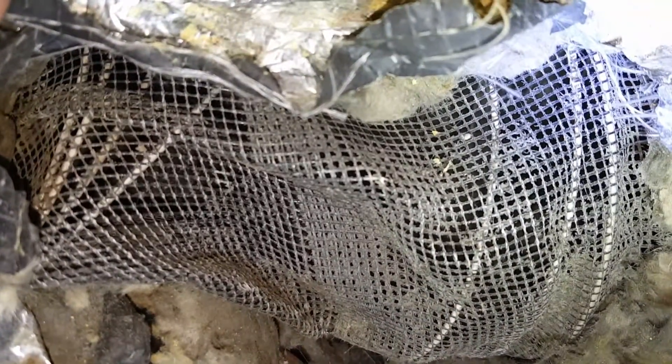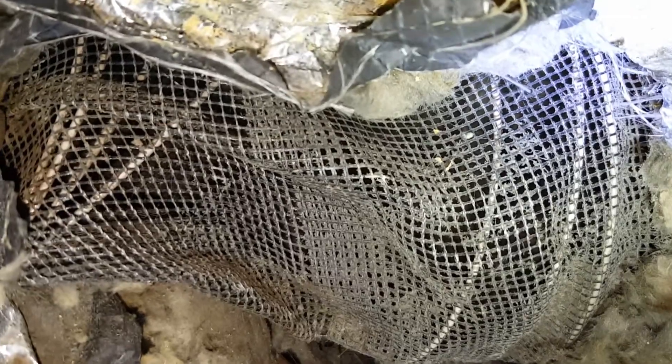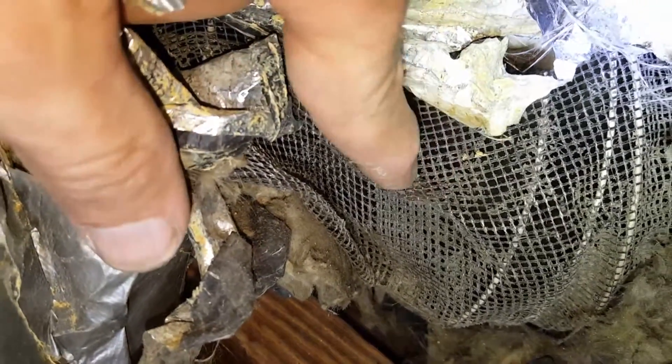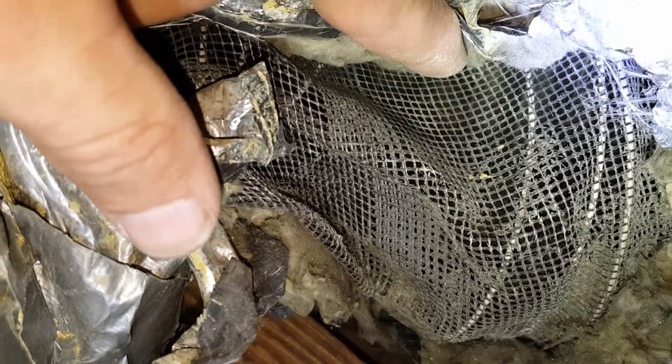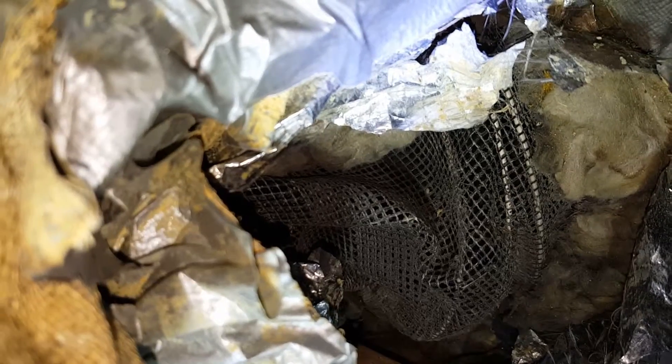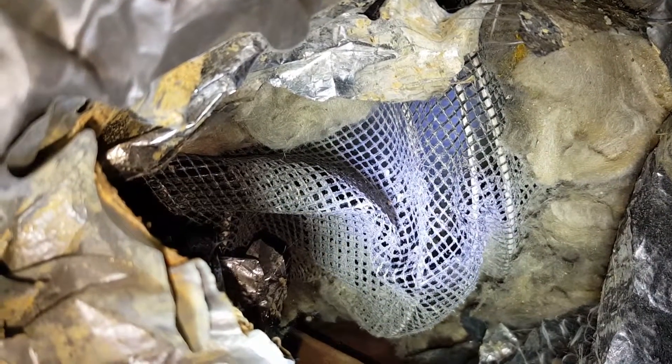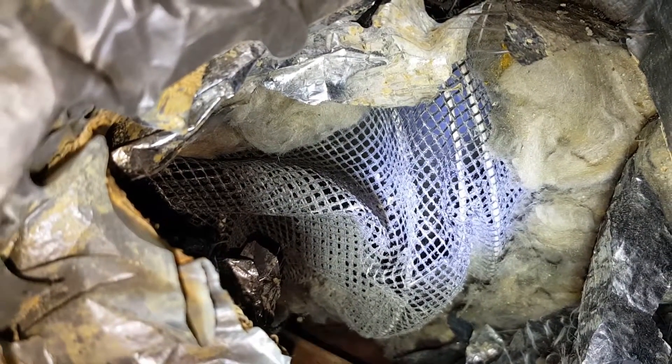I just can't get over this — let me show you one more time. That is not your typical duct liner in flexible duct work. Usually it's sealed — basically vinyl or plastic of some sort — but this one is a net that leaks out all the air. It's kind of like running tires with a hundred holes in each tire and expecting it to hold air. It just won't happen. Thanks a lot — subscribe and like my channel.